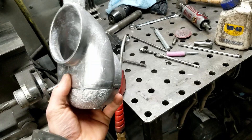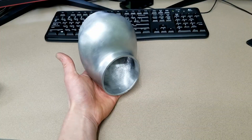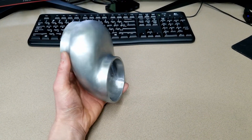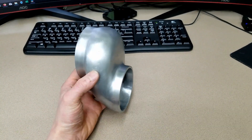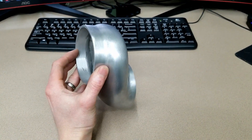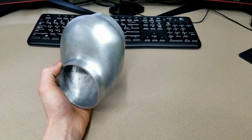This is the pour done afterwards. What I'm going to do is weld up along this and grind it all out. Here's a shot of the finished part — welded it up, ground it down, did a little sanding with a DA sander and a scotch brite pad, then machined the inside. That turned out fairly well, so go ahead and test it out!